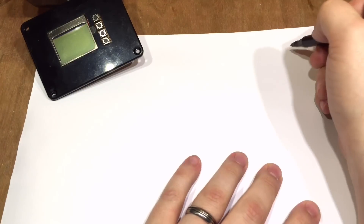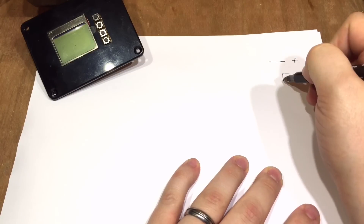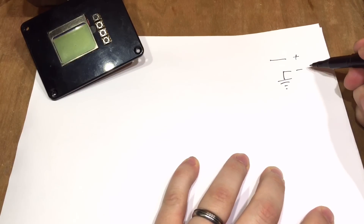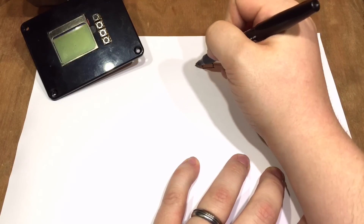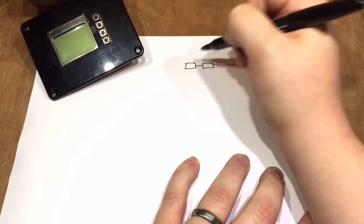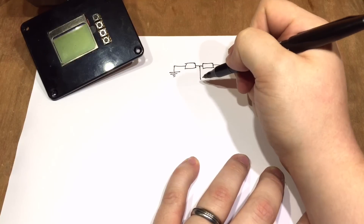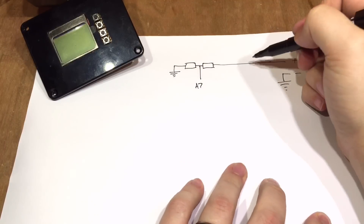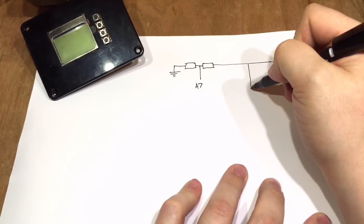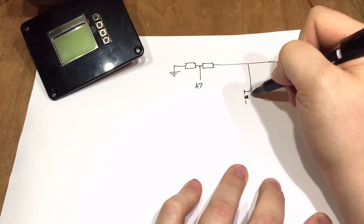This is version 27 or something of the hardware. Essentially we've got the DC power supply we're testing on the right-hand side — positive and negative — and that goes through a voltage divider back to ground. This goes to an analog pin; I'm using analog 7. The main power comes down here going into the N-channel MOSFET.